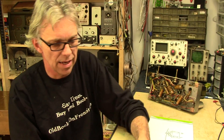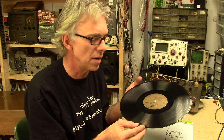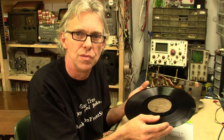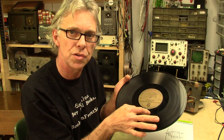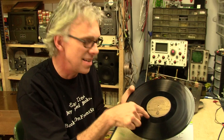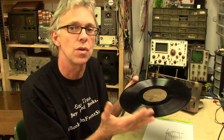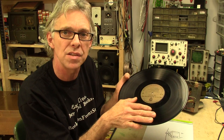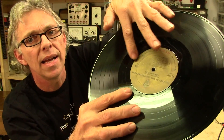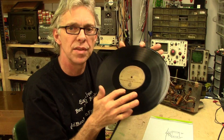There are some really strange things that go on on a record. When you're on the outside of the record, obviously when it's spinning at 33 and a third RPM, it has a lot more time out here to actually get all that information squeezed into a groove, so you have better fidelity on the outside of a record. As it gets closer and closer to the middle, you're crushing all of that waveform into a smaller space because there's less distance from point A to point B around the record. So a lot of engineers will mix the things that have really loud bass transitions or very high highs out toward the outer tracks, and leave the softer passages and quieter tracks toward the inside. If you try to cram a lot of information toward the inside, the fidelity does indeed suffer.